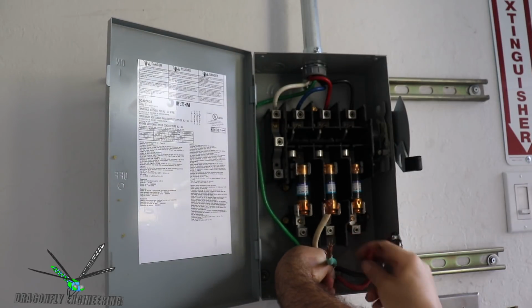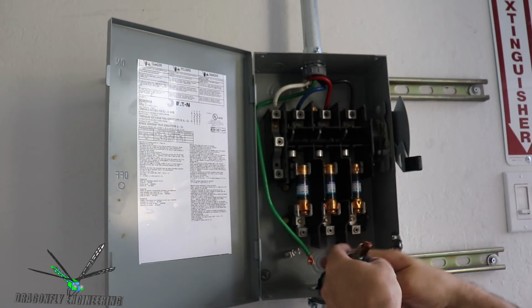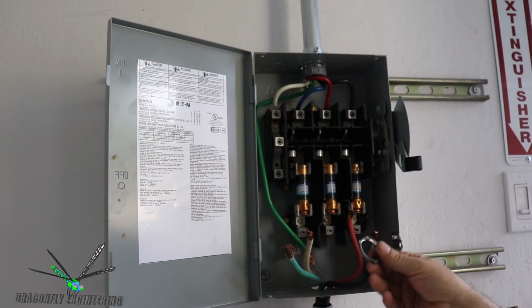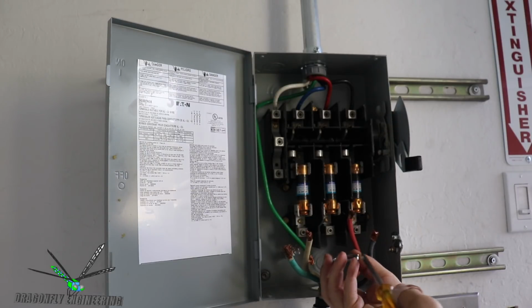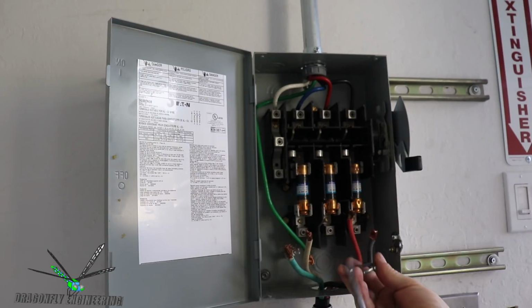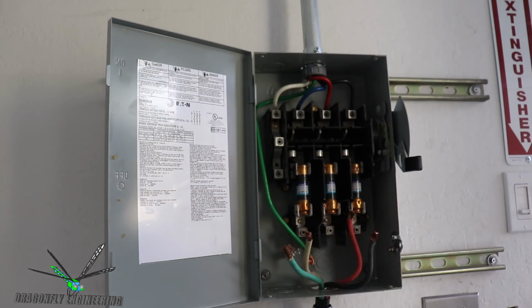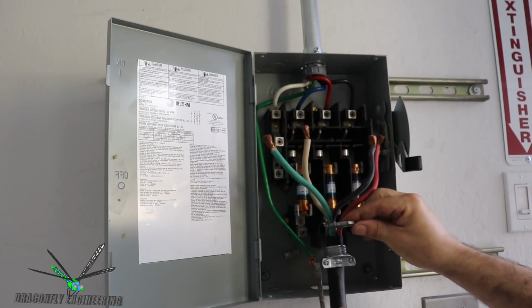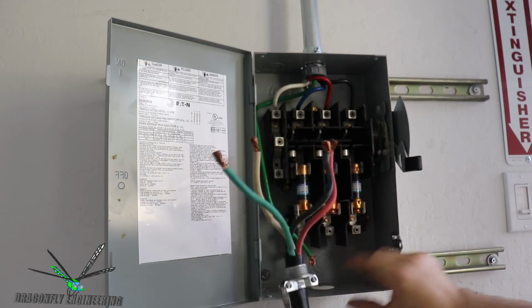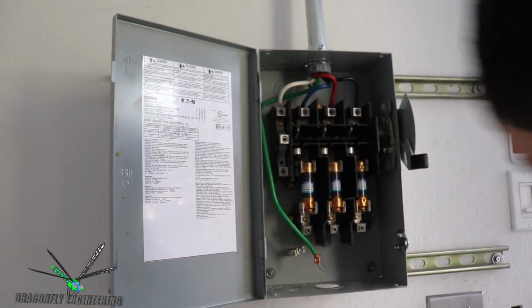So this conduit is held in by this thin nut here with tines. A lot of times you can tighten this nut down by pushing on the edges with your screwdriver. Kind of just tighten it. Sometimes you can whack your screwdriver with your palm. And then the other side is, so this nut screws down and clamps onto the sheet metal of your box, like so. Okay, let's toss that.